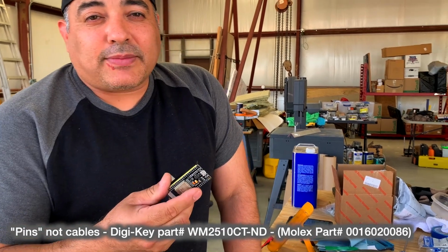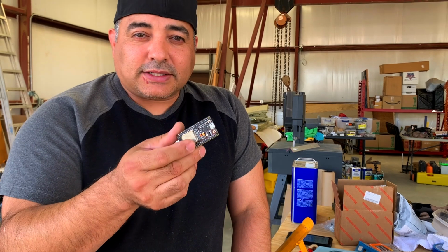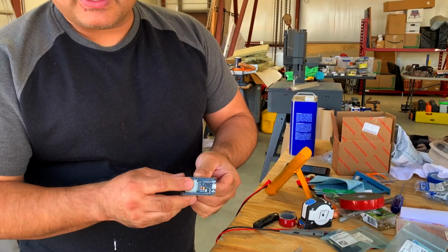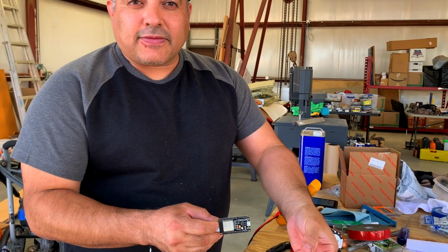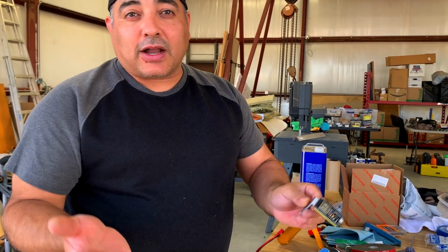So we'll probably have about 18 wires or so going to each of these little processors, which will then go to MOSFET boards. One of the reasons we've done that is if one of these processors goes bad, we would just pull 2 of these off, pull this off of the standoff, program it, glue another one on there, put the 2 connections back on, and we're up and running.